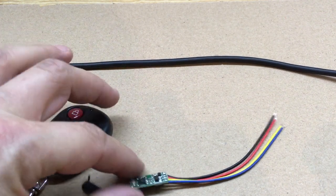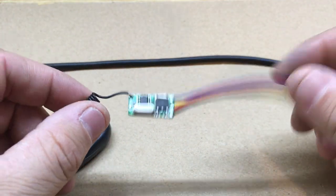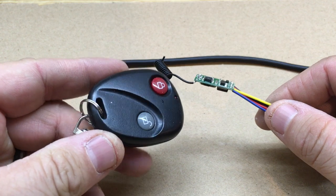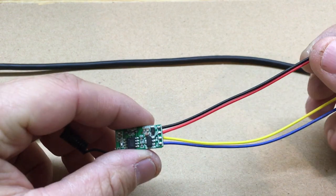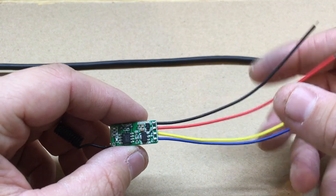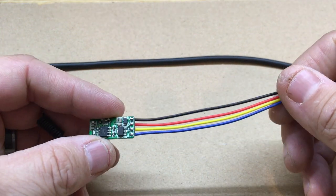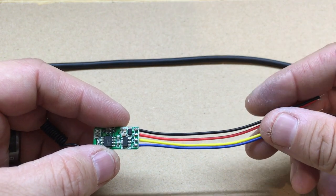Fuzz Pie Guy here. You're looking at a wireless remote that runs off 433 megahertz — it's got a little key fob here. These two wires are power in and power out. I'm going to use this for 5 volts; it's good for one amp, which is fine for what I'm going to use it for — the draw is nowhere near that. This is for my GOES radio, my GOES satellite setup.